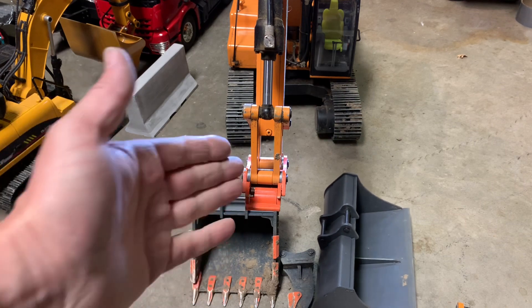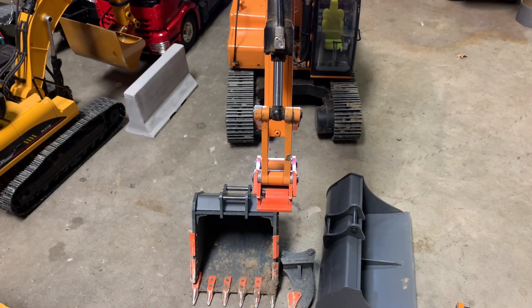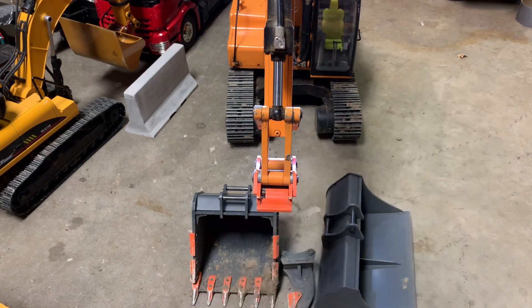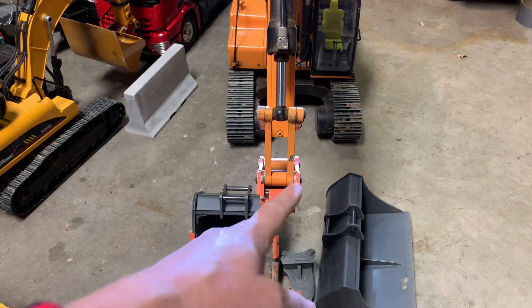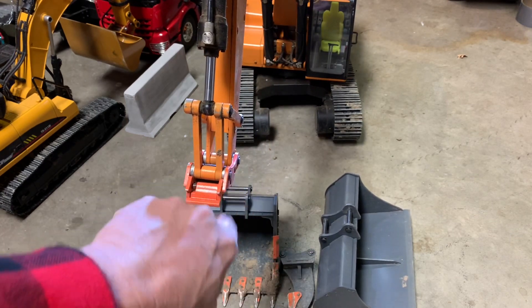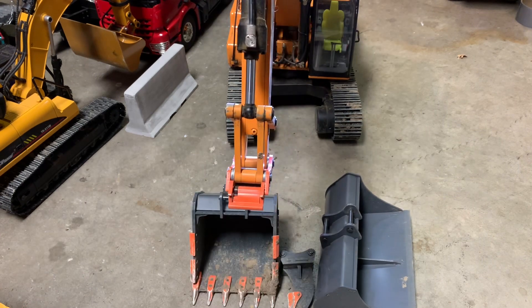I never went into detail about what I did on this unit, but that's it — it's actually really super simple. If you get rid of this bucket, it really simplifies things to just doing those washers. These were the pins that even come with it — just the C-clip pins — so it's all secured on C-clips. Now you can just easily accessorize your excavator.